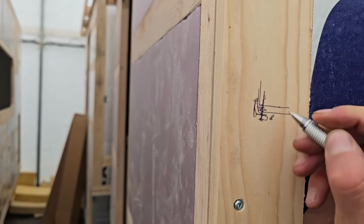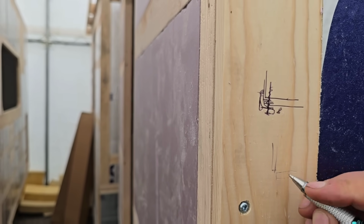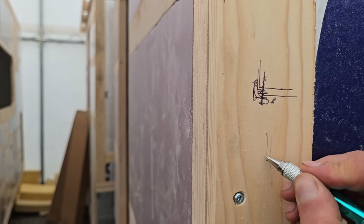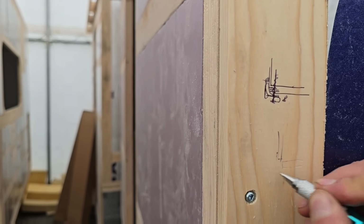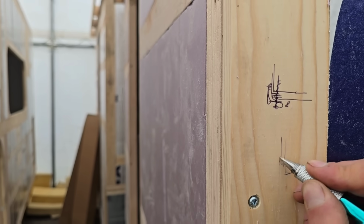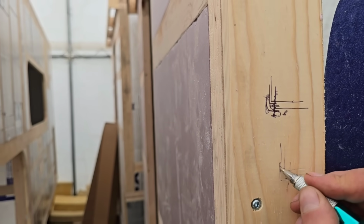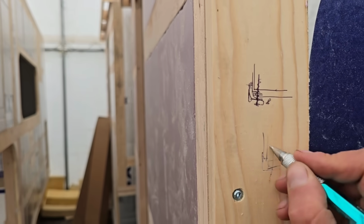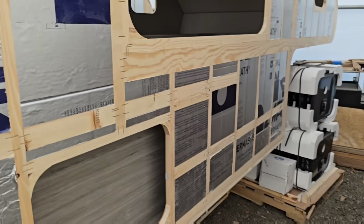And then you trim all this off and you put a bead of sealant here and a bead of sealant here. Whereas the other manufacturers have a butt corner like this, and then you have a little bit of sealant put on, no putty tape, have a little bit of sealant, some putty tape on this side, and then the leg of the rail and the screw goes here. And so what's going to happen with all those bad friction joints? It's going to break right there. Just crazy, guys. That's how these things are built.